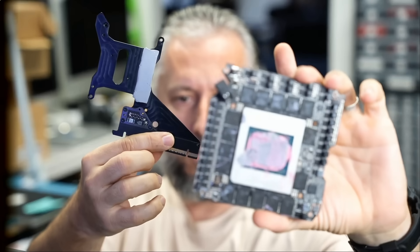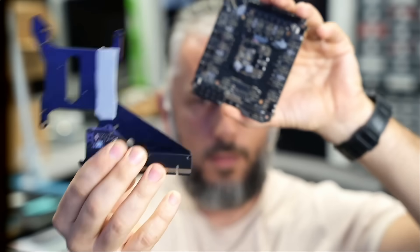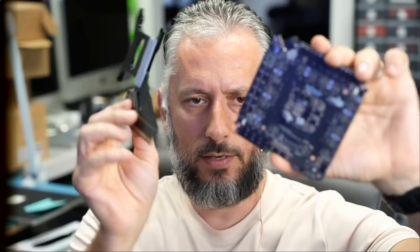But it's not the water block itself that's the problem — it's the bits and pieces found on the 5090 Founders Edition that's the problem. The card comes with the PCIe connector and the card itself — that's the 5090 Founders Edition. What a stupid design. The PCIe connector, which is this block right here, must connect via a very fragile FPC connector. It clicks in, and that's how this connects with this. You have another connector here, and something else connects with that connector.